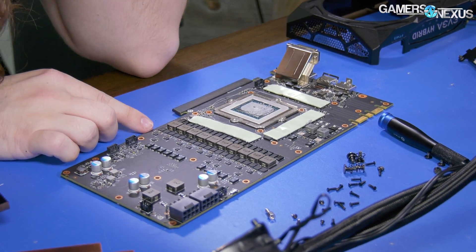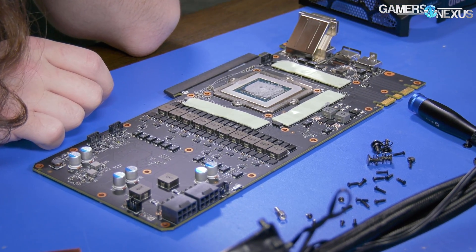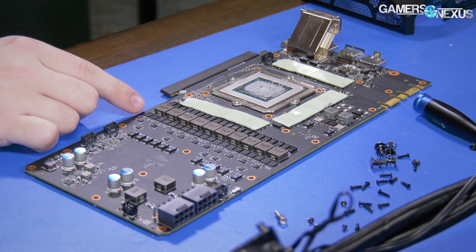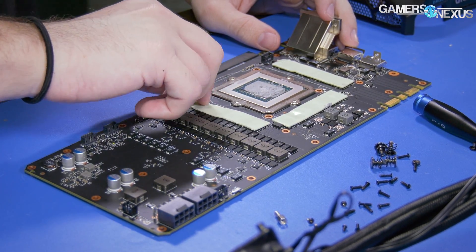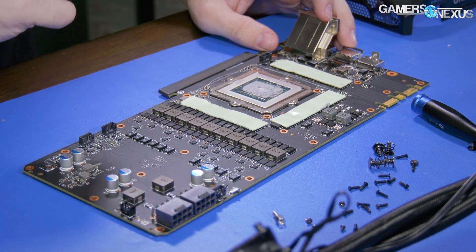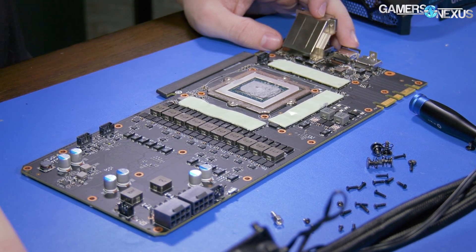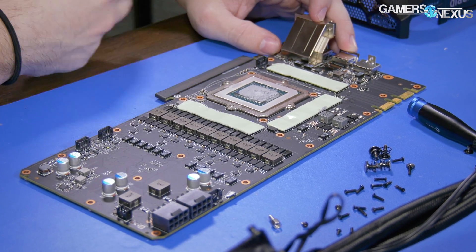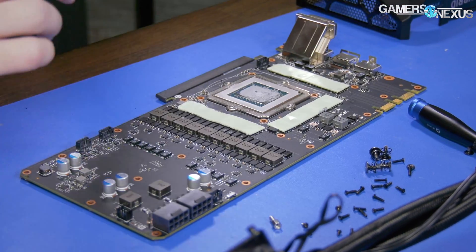So these are the same as the FTW3 - these are the 6930s, which we saw on the FTW3 as well. This VRAM I think is identical; we have videos about it from the air-cooled version of the card. It looks the same. It's just an FTW3 PCB, an FTW3 VRM - it's a new cooler, a different cooler. That's the only major change. Same BIOS switch up here, same board layout. In fact, I think you could take an FTW3 air cooler and just mount it here and it would work.